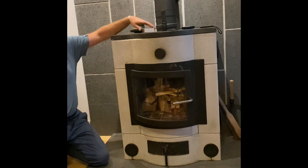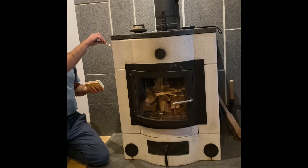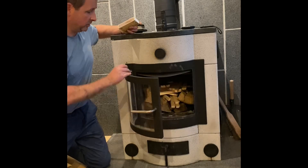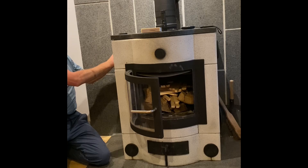The easier way is a match — get the match going nicely, take it closer, and you can see it disappearing and pulling up the chimney. Eventually it'll just go out. So we've got good draft — we don't have a problem with a cold plug. Then we're going to pop our bung back in.